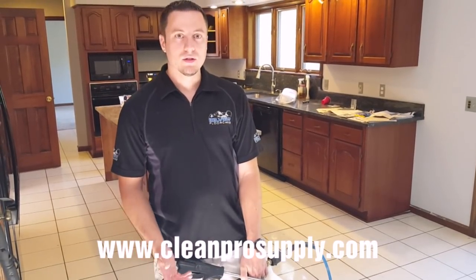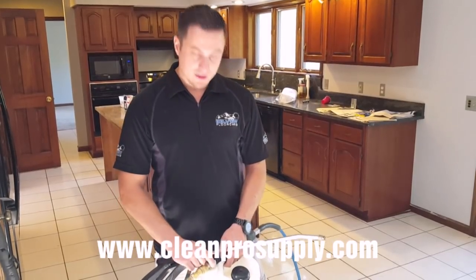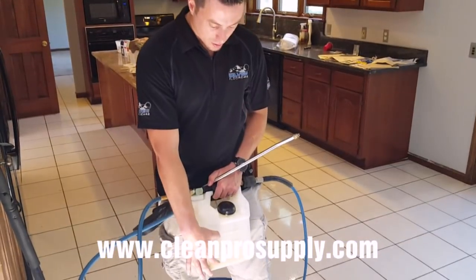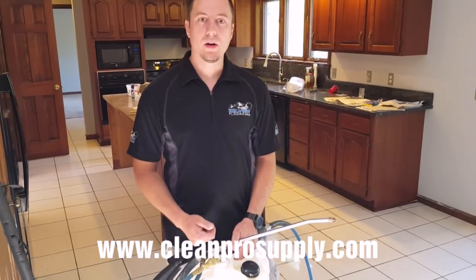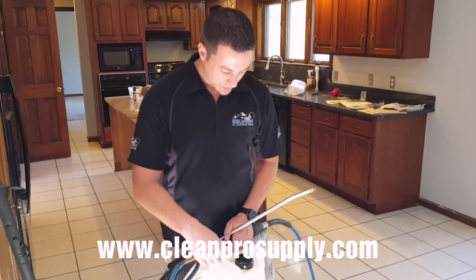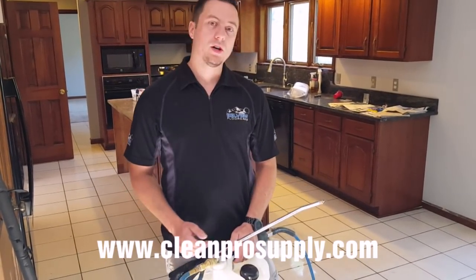The only thing you have to be careful of is overspray when using a Hydroforce sprayer. If you have the yellow tip in, that's going to be a 1-to-8 dilution. You're going to do 4 quarts of 2790 and 1 quart of water — shake it around. Preferably use warm water through your truck mount, portable, water otter, or water hog. That will make about 12 gallons of spray by the time you deplete the jug.